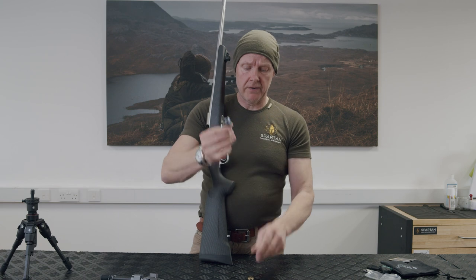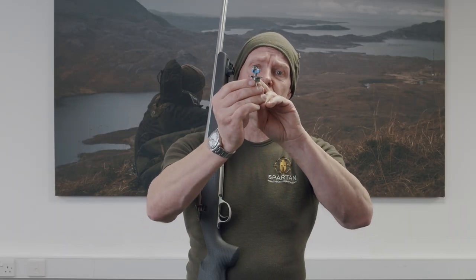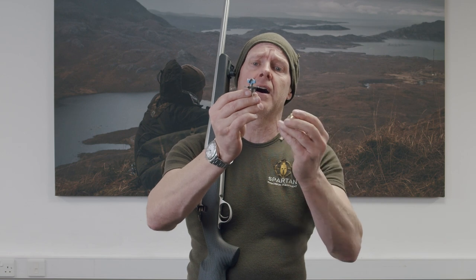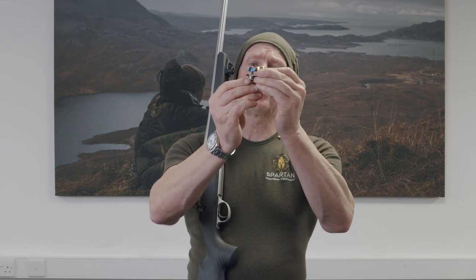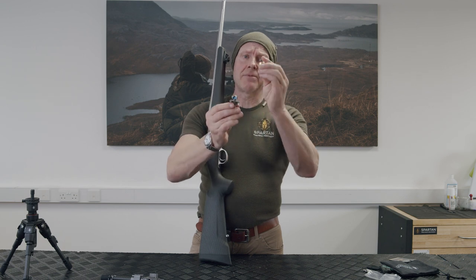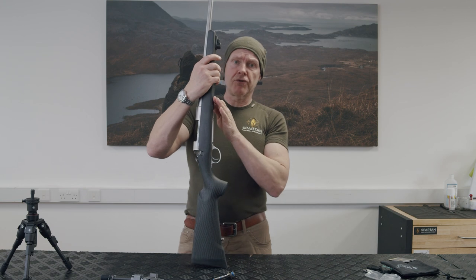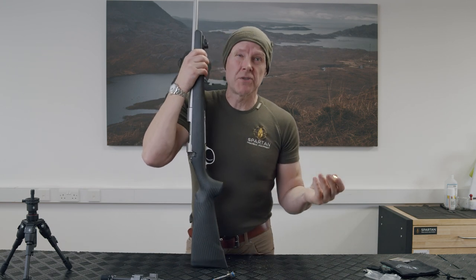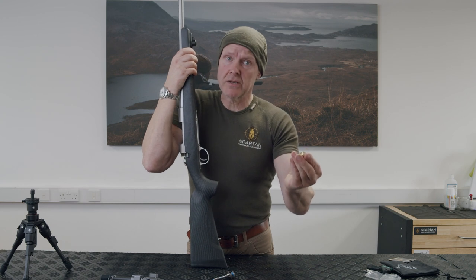That's the Forstner bit you set, and what I do is use a stop plate — a great little tool because it stops you going too far. I set it just two millimeters shy of the gunsmith adapter's full length, meaning I've got a little bit of protrusion when it's fitted — about a sixteenth of an inch. That's a personal choice, you can set it how you like.